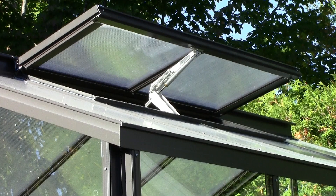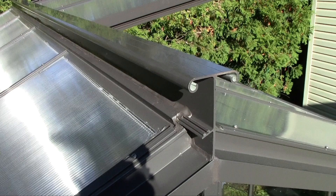With the ProGlaze, you need to seal the polycarbonate on the right side of the vent slider, on the left side, and the bottom side of the vent slider, and also on the side of the glazing bar for around 2 to 3 inches long. For the top part of the roof, you need to seal the top part of the polycarbonate panel using the ProGlaze, and also on each side of the glazing bar for around 2 to 3 inches long.